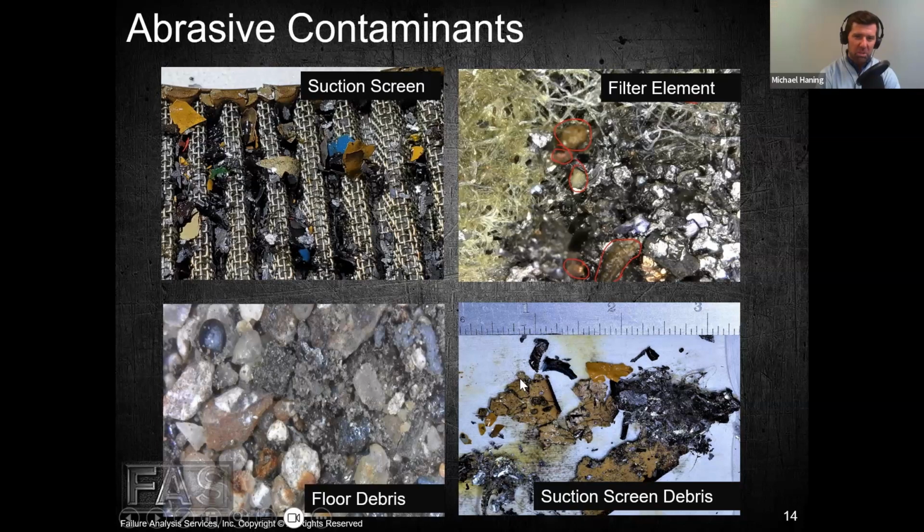Are those paint chips? So this is paint here. I'm in the lower right quadrant now, Mike. You see the scale here, we can tell the size of these pieces. These are pretty good sized pieces, right? I mean, that's an inch right there. So this stuff here is gasket material. This black stuff up here is O-ring material. This is a paint chip.